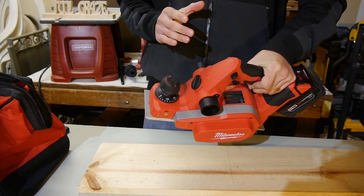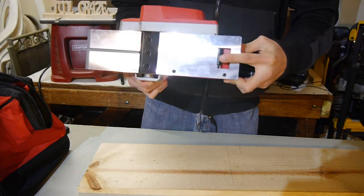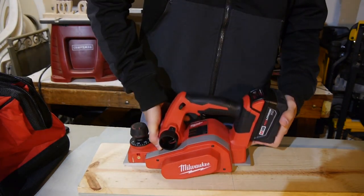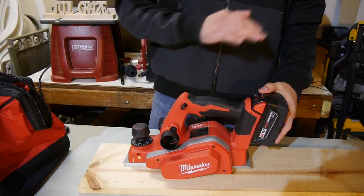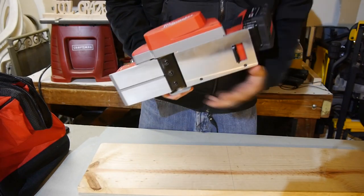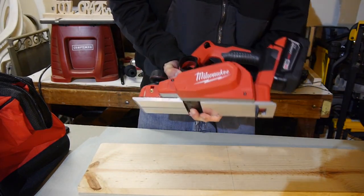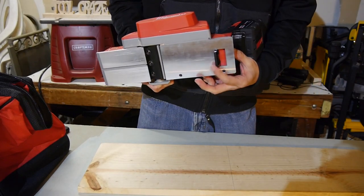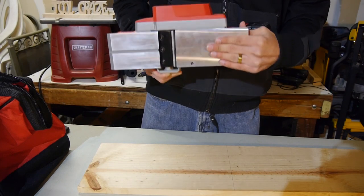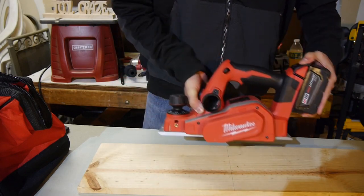It does have a couple of interesting features. One is a pretty big blade saving feature, as it has a plastic tab on the bottom of the base plate that keeps the cutting head lifted off the ground when you set the tool down. This prevents you from accidentally damaging the blades when you set the tool down, as most people are going to forget to move the cutting head so that the blades are out of the way. The tab is spring loaded to open on its own, and it folds back automatically when you use the tool, so you don't even have to think about flipping it out when you're done using the tool or laying it flat when you want to use the tool.